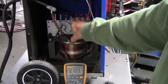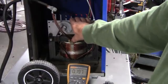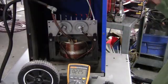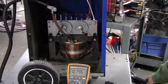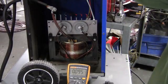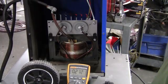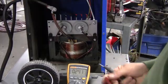It is seeing most of the load from these units, and if customers crank too long and overheat this, they will burn out. So the first test we do is we disconnect the output leads from the battery so that we don't get any false readings. I just dropped them onto the floor so they don't touch the battery. We turn the charger on, set the rate switch to 12 — medium is fine, you can use 12-volt — we're going to test all of them.